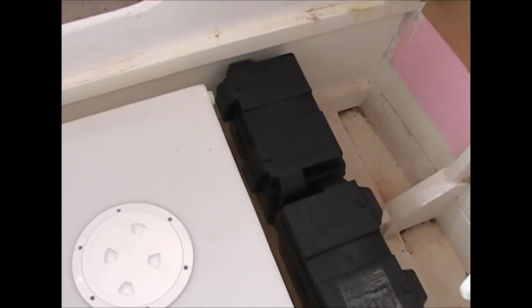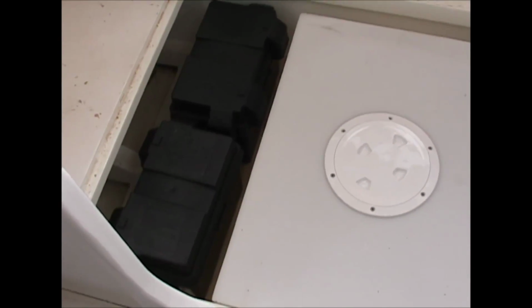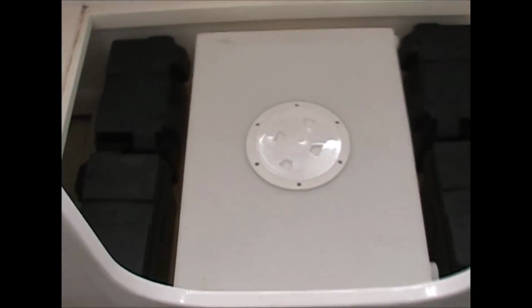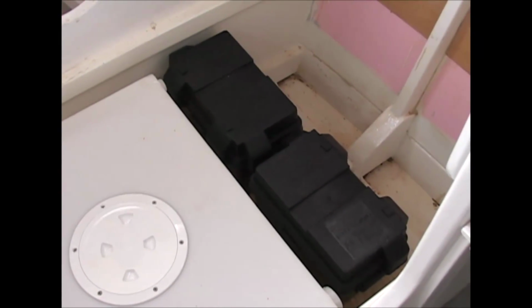I was going to run the golf cart batteries in here, but sometimes you run into a charging issue with them when there's 12 volts. I can get a standard 12-volt charger. And if I ran 4-6 volts as a house bank, I'd have to have another battery somewhere as an emergency start. After doing a lot of research and studying what other people are running, it seems like mostly they're doing this. The 4 batteries will balance the boat out real well.